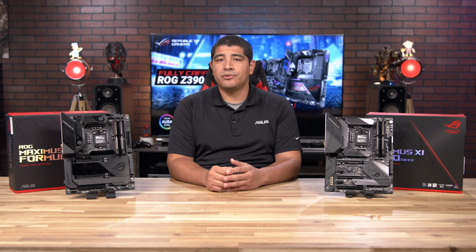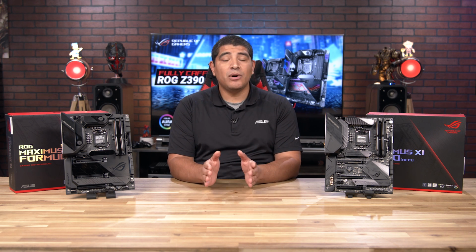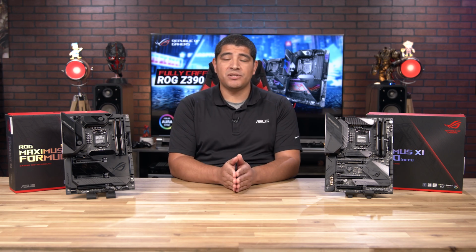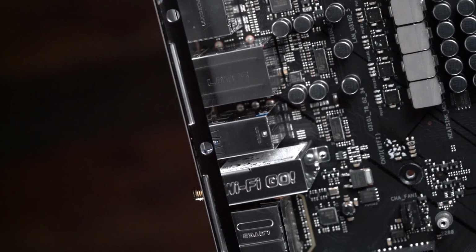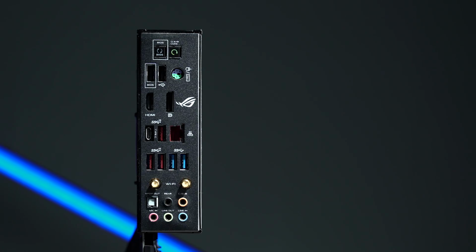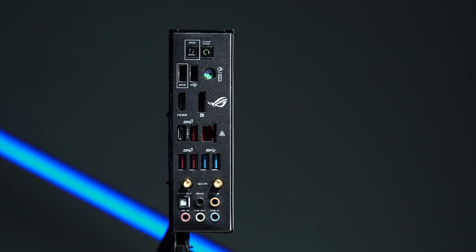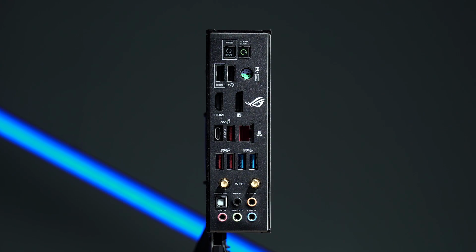Well, it's important from the respect that it's all about performance. With previous Wi-Fi modules, they were operating in either 40 megahertz or 80 megahertz. These new 160 megahertz Wi-Fi chips, when working in conjunction with a 160 megahertz compatible router, will offer for the first time true gigabit wireless performance. Beyond that, they also offer full support for multi-user MIMO. This is a key technology which improves the overall efficiency of multiple devices connecting to a router to really be able to ensure that they get low latency and great wireless connected experiences.